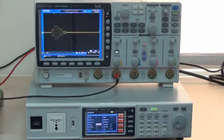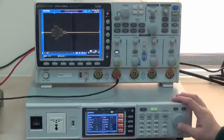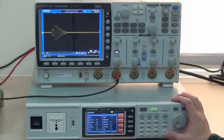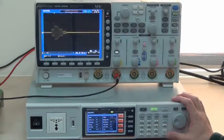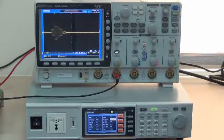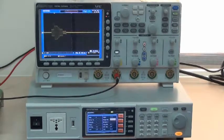Next, enter step 5. Enter. Select 5 and press enter. And next, turn up to jump count. Press enter. Select 1 to execute twice. Press once again output key and press F4 run to trigger to complete the process. Continuous and various power output can be produced through varying set of step settings.